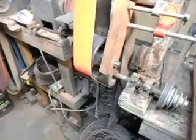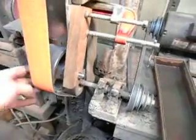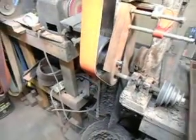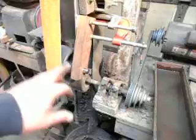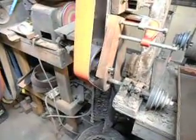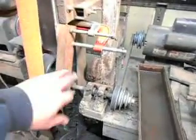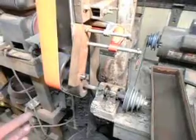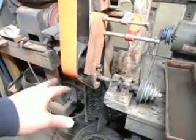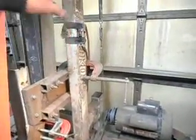I do have one coming on order — it's a 2-inch wide by 2-inch diameter commercial wheel. I wanted to try it and see if it would work the same way, just for the guys that don't have a lathe. It's a nice hollow grind here. You can just loosen up these clamps and pull the wheel way out if you want to. If you pull it out too much further than this, you'll need to adjust the spring tension on your tensioning arm.